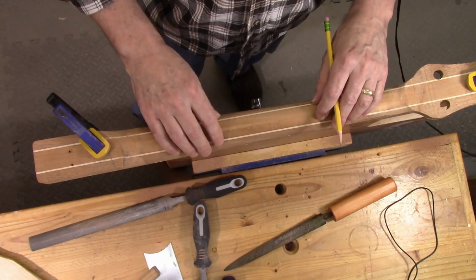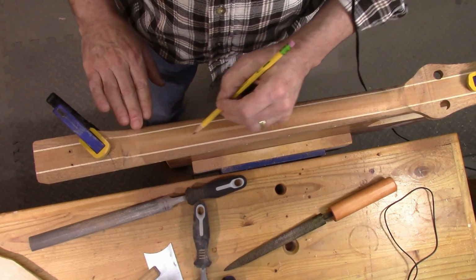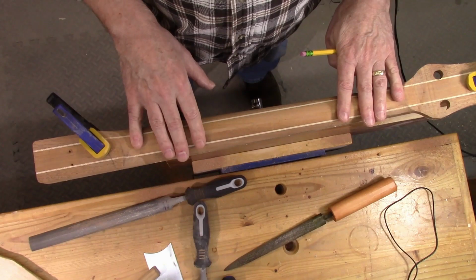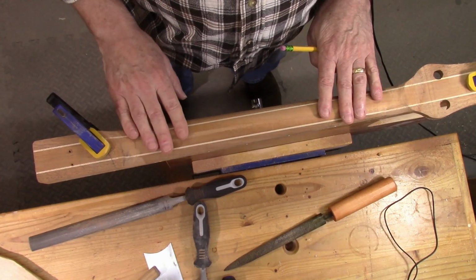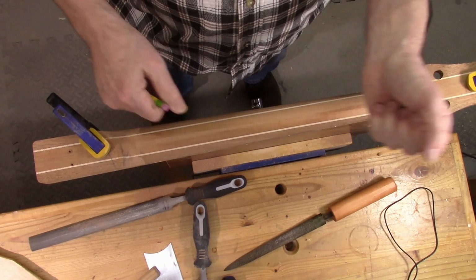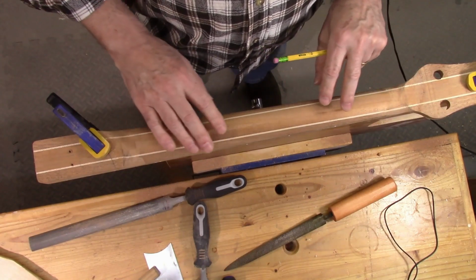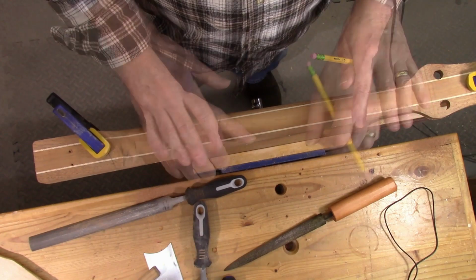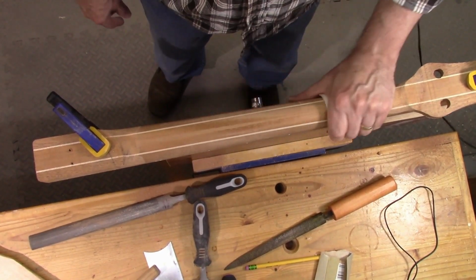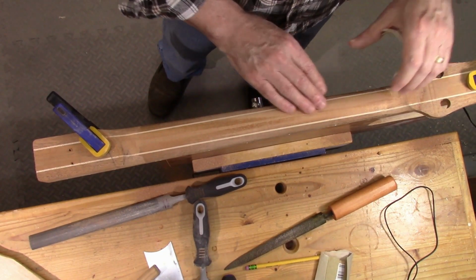Other than that, it just feels, especially up in here, just because of the way the grain is, there's some natural roughness that needs to be sanded back. This side actually is really close, but I can look at this now and know where I'm going with it. So now it just becomes a patient, slow go: filing, sanding, double checking it. I will take it off the jig and literally sit in a playing position and see how it feels in my hand. Do I need to thin it down a little more? Is there a rough spot? All that type of thing. So even without any finish, I want it to feel comfortable. So I can do this and it'll give me a nice, even, smooth sand, and that little bit left by the router here will come off very quickly.